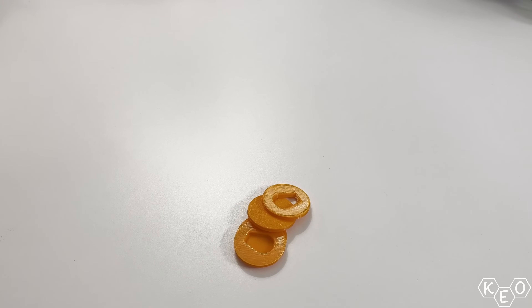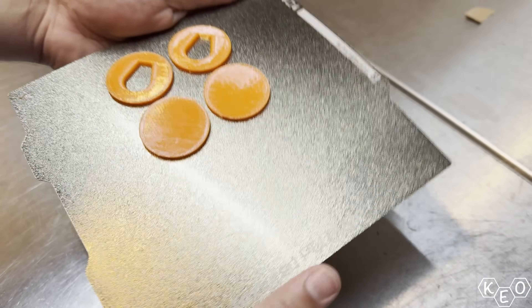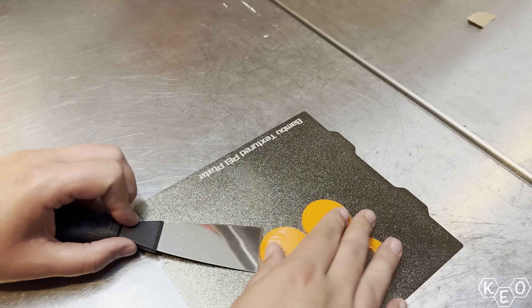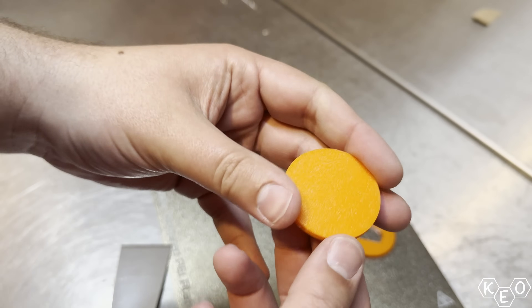Good comment, good feedback, much better solution. I went ahead and modeled these adapters as well as some solid plugs — you'll see why we have the plugs at the end of the video. I'm using this Polymaker orange 95A TPU; there's a link in the description. This is what I've been using for this whole project. It prints like a dream on the Bambu Lab machines, although the TPU sticks to the PEI spring steel plate like nothing I've ever worked with, so glue stick next time.